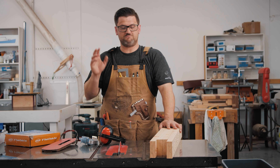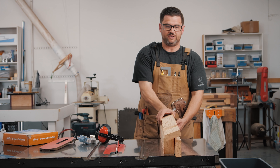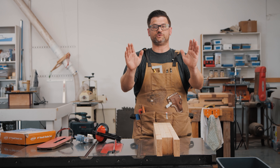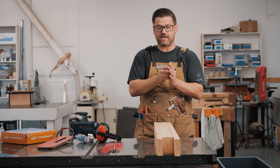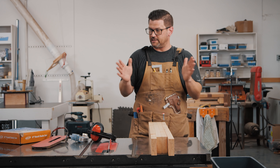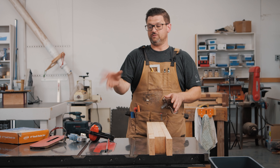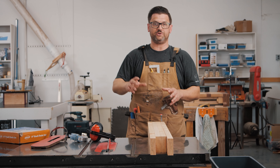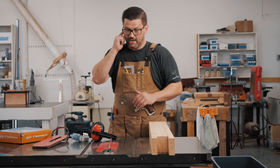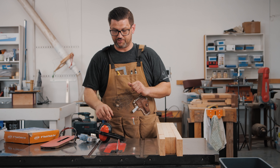This part is for alignment - you don't need to do it if you just want to slap some of these together, you can just screw them in. We're going to make I-beams, but I'm going to cut a little groove just for alignment so that putting them together is really easy. I'm going to use a dado stack - you could use a router or anything with an edge guide. If you have something wide enough to do it in one pass, make sure you're aligning down the middle. If you're going to do it in two passes, you just cut one way, flip it around, cut the other way, and you have it perfectly in the middle. I'll do a couple test cuts to make sure it fits nice and tight, and then we'll go ahead and put it together.